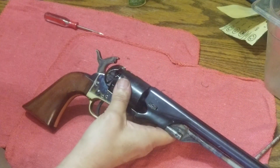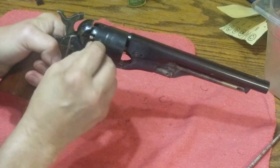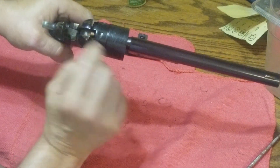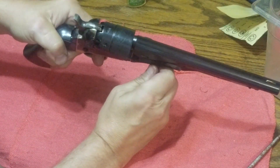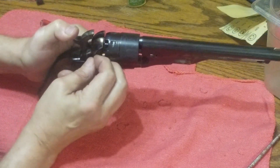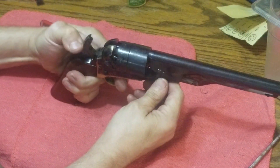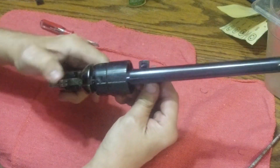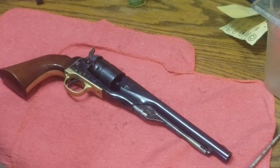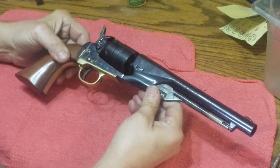And we're back in business. To show you that I did actually resolve that problem: with one cap in an empty cylinder — now you see it's cocked on the cap, now I can lower the hammer onto the cap, and then I can cock it again. I couldn't do that before. Problem solved. The action is a lot smoother now too, and the hammer spring is even a little firmer. Thank you for watching my two-part series on the disassembly, cleaning, polishing, and reassembly of the Colt 1860 black powder revolver.